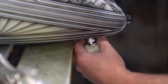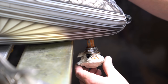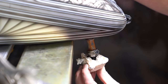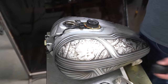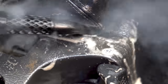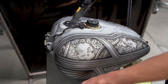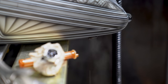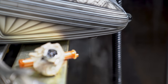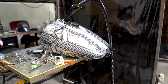First I'll pull the fuel valve out. I know what the valve is actually called but YouTube doesn't really like the word, so we're just going to call it a fuel valve from now on. Next I'm going to grab my steam machine. I usually use this to detail cars but it's really good at pulling fumes out of a tank in just a few minutes. The steam is water vapor, and water and gas don't mix. The hot water vapor fills up the tank, releases fuel molecules causing them to sit on top of the water, and as the steam condenses it drains out of the bottom of the fuel valve port. A similar effect is achieved when you use the popular internet method of hooking up your car's exhaust to it — the hot exhaust creates steam which does the exact same thing.